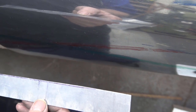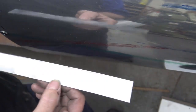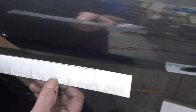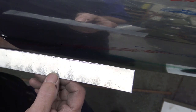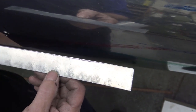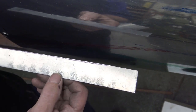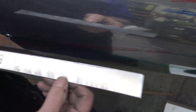Now, another thing that you do need is the outside profile, because you need to keep your eyes on where they are and check them at all times. Again, if you don't do that, it's going to bite. So, in a minute I'm going to show you all the profiles. Now, someone said to me once, I can't remember where it was, that it's very difficult on a buck to make a panel because you can't see the buck on the inside, or blah, blah, blah.